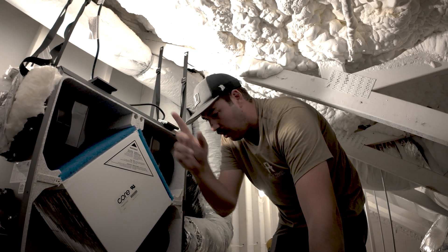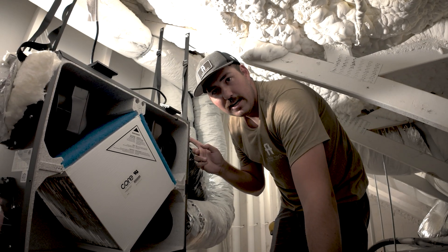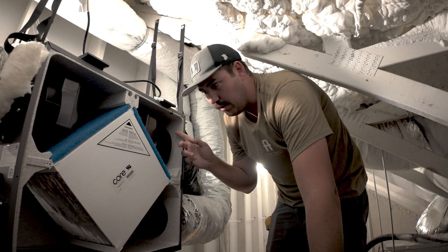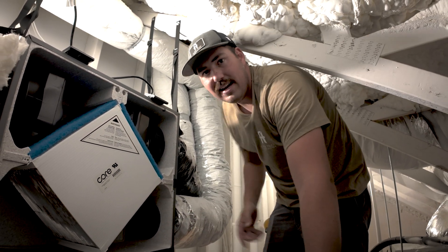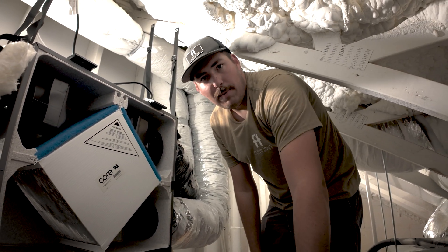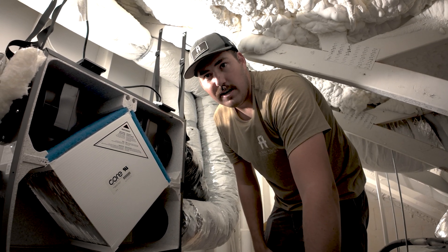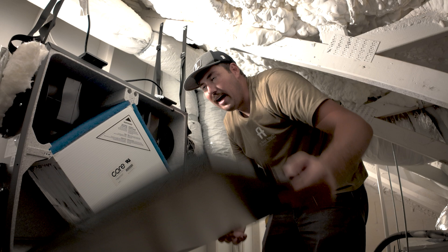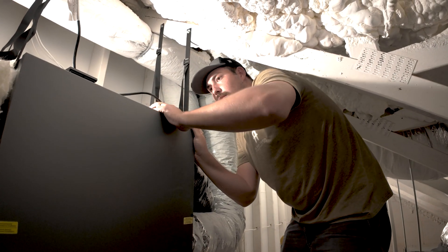So that's the energy recovery ventilator. Hot air coming from outside passes over this and comes down from a hundred degrees to 80 degrees, because the air inside our house was 72. The fresh air passes through the coils and now we control what air is coming back into the home. It also benefits from filtration, so you're not bringing in contaminants.